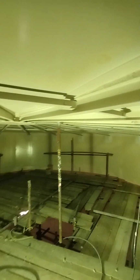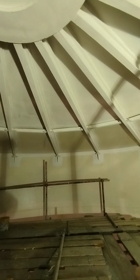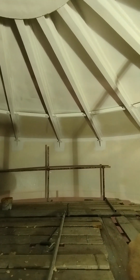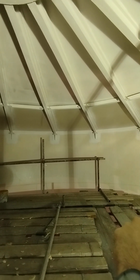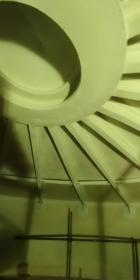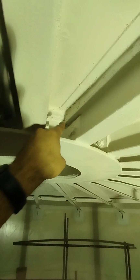And demineralized water could penetrate these areas and create a high amount of corrosion, which led to the release of Fe2O3, which is iron oxide, and is detrimental to the quality of the demineralized water which was going to be stored here. Also, you can see we have a lot of places that the humidity of that water could reach,